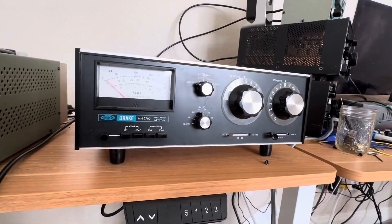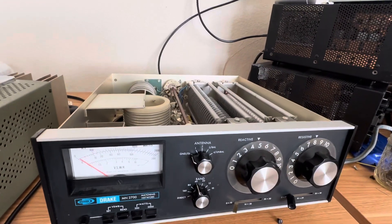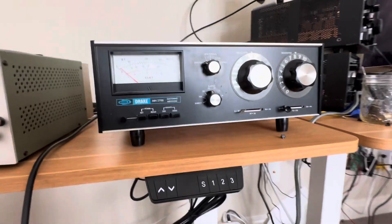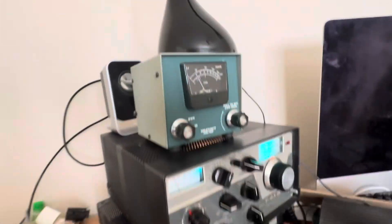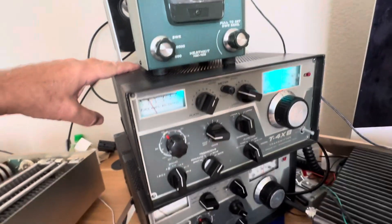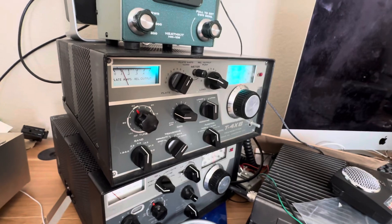Not happy about that. Anyway, so that's it — if you can't dial out SWR, sometimes suspect your transmitter. This Drake is faithfully throwing out some power with 6146 finals and it appears to be steady and stable.